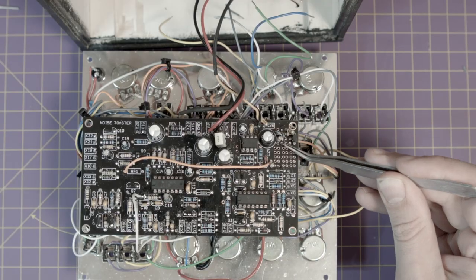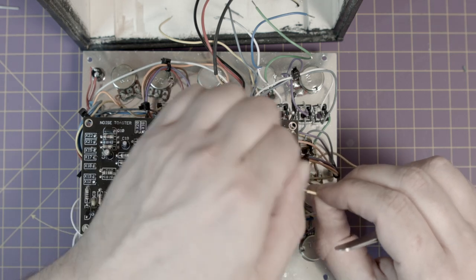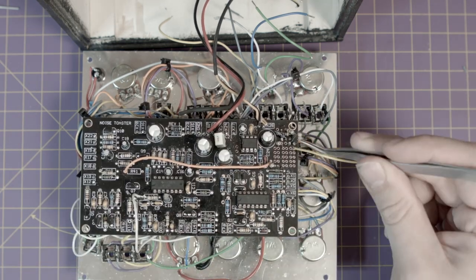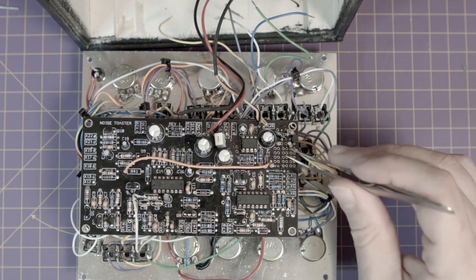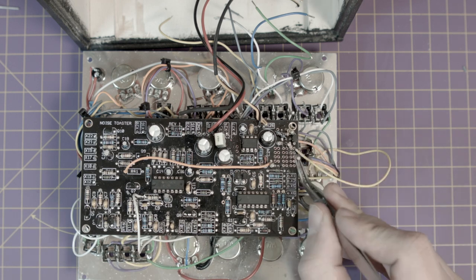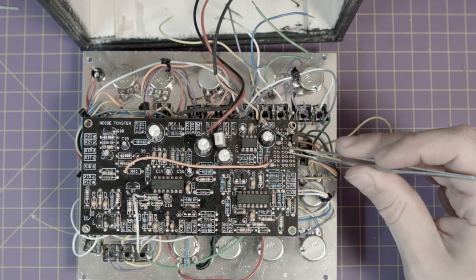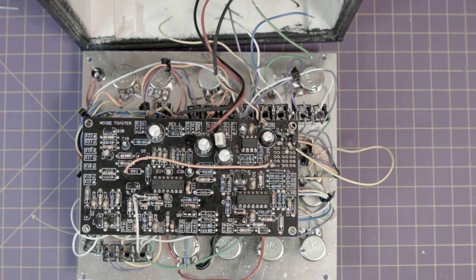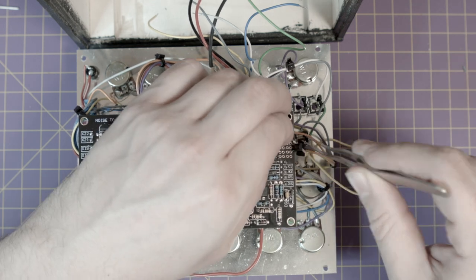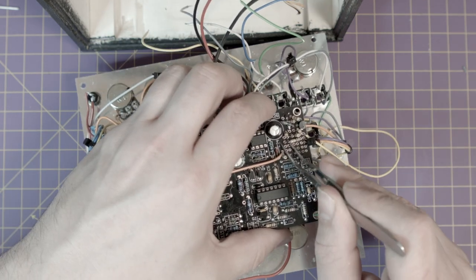So here I'm laying out the components to make sure it'll work before I solder it all together. There is a 100K coming from battery positive and connecting to a 39K coming from our yellow signal wire from the faceplate. Then the junction of these two resistors is connected to the gate of our transistor via another 39K resistor. And finally, a 100K resistor between battery negative and the gate, which will have to share the same hole as the 39K resistor.